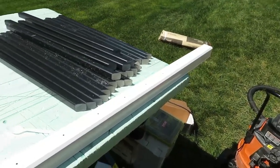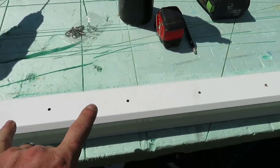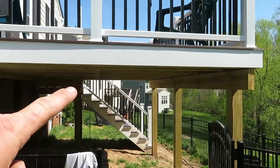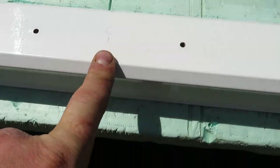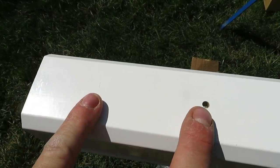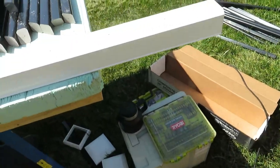One of the really important things with the bottom cap rail is that because it comes pre-drilled, I have to make sure I'm centering the whole hole pattern on the overall length of the piece. It didn't matter for the bottom rail because it gets covered up. But here I have to figure out if a hole or the midpoint between two holes is going to be my center point — in this case it's midway between two holes. If you forget to do that, you need to order a new rail section. Don't ask me how I know, and it's totally not been more than once that I've made that mistake.